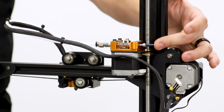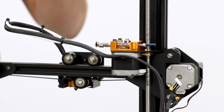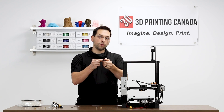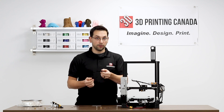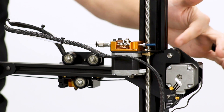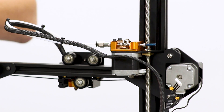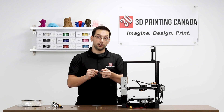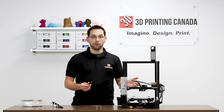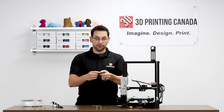There's now a PTFE tube leading into the inlet of the lever, which provides a couple of nice benefits. Number one, you won't get any grease from your lead screw on your filament as it comes down through here. Number two, because the filament coming from a top-mounted spool has a bias toward the top, you can end up with a groove worn into your lever — this can happen on both aluminum and plastic ones. So at the very least, if you're keeping the plastic lever, I'd suggest drilling it out and adding a small piece of scrap PTFE, so that if it wears out from abrasion you can easily replace that piece rather than the whole extruder lever. I myself had filament get caught in a worn groove on an Ender 3, causing massive under-extrusion that was tricky to troubleshoot.